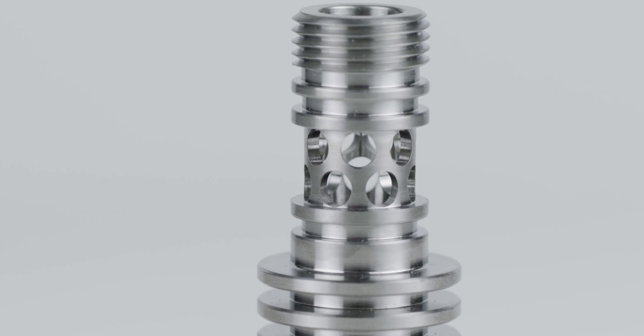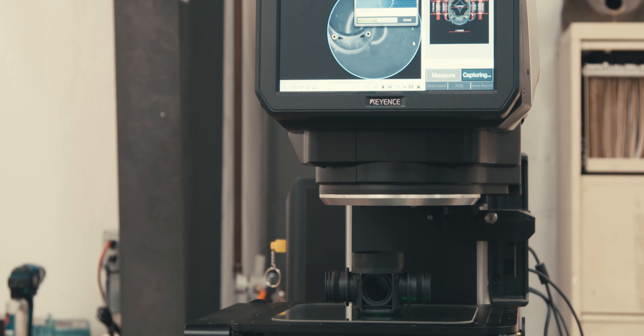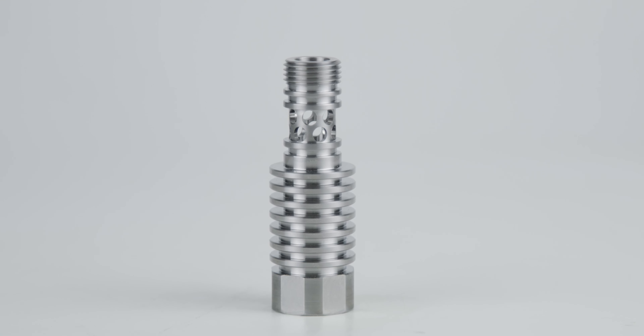Here's another part that gets partially done on here. The hex and a couple of other operations are done on here — the holes around here. And this piece is made out of titanium. So we do a lot of stuff in house that we wouldn't do out of house normally because our quantities are lower. Outsourcing a lot of the parts costs a lot more money. But the advantage of doing it in house is the level of quality that we're going to apply. This is checked step by step — each operation is checked with the CMM machines and the instant measuring machines. So this is the highest level of quality that we can do. If we were to outsource this, we wouldn't be getting that because we'd have to walk through every step of the process outside the house, and that's not going to happen. This is the way to go.